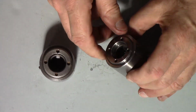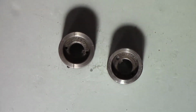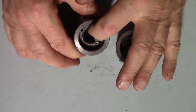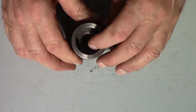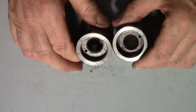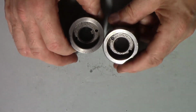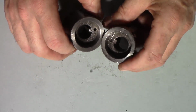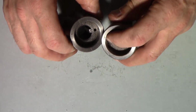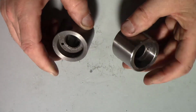So I got more than I was expecting on the new one, which in a way is quite a good thing, because I don't know if you can see that, the old one was pretty rusted, pitted here, and I had wondered, shall I just skim this in the Chinese mini lathe just to make it smooth? But this one is obviously smooth. Funnily enough, it looks as if maybe this has come off some fairly new lathe, because it's obviously been used. This is where the ball bearings run round when the torque limit comes into effect.